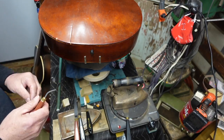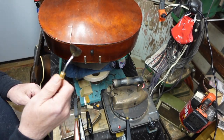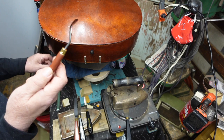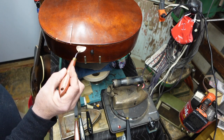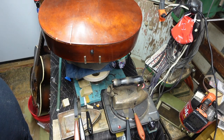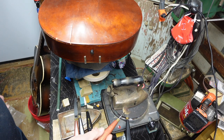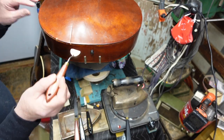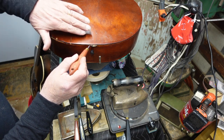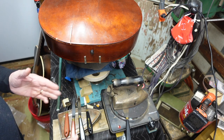This is a palette knife — it used to be this long. I took a piece of tape, marked it off, took a disc grinder, cut it off and rounded it off, and it is now about the depth of the kerfing. So when I heat this up with my iron and slip this in here, I don't have to worry about getting whatever is way inside cut loose when I'm using it.